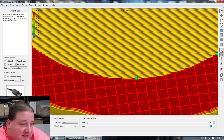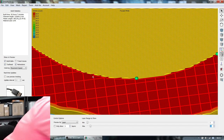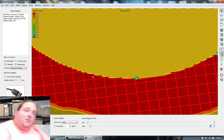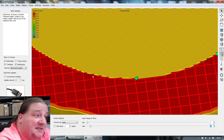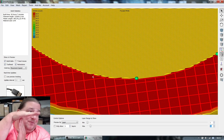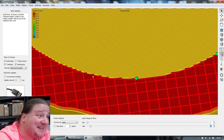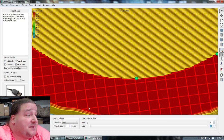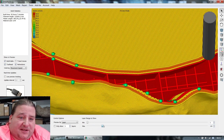At 25% infill, the gaps are very tiny. A dead overhang over a gap that tiny works surprisingly well — the filament has inertia and plasticity and will actually air-bridge over a very small gap. So 25% infill works. Once that section is done, we switch to 5% and you can see very little infill being used.